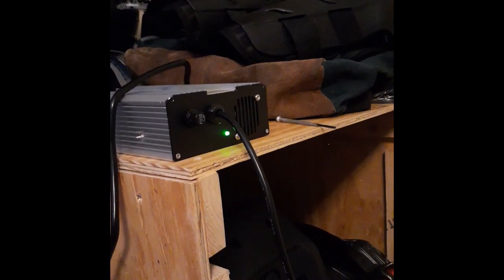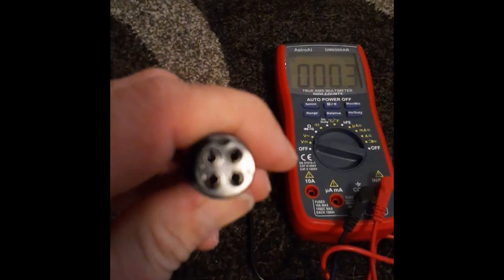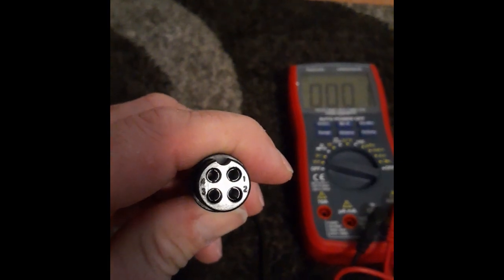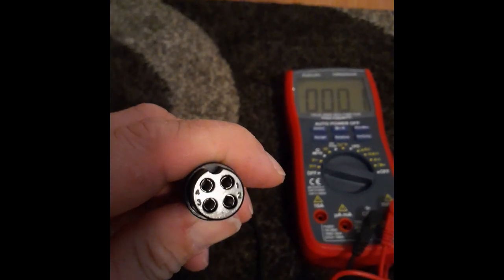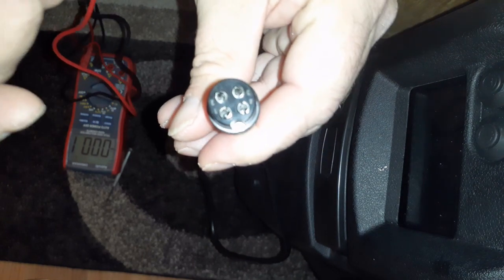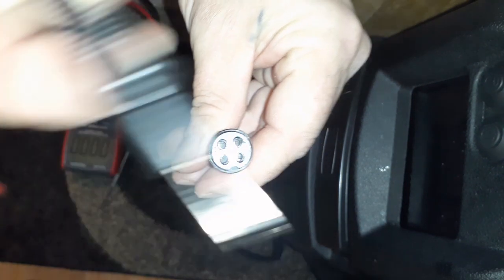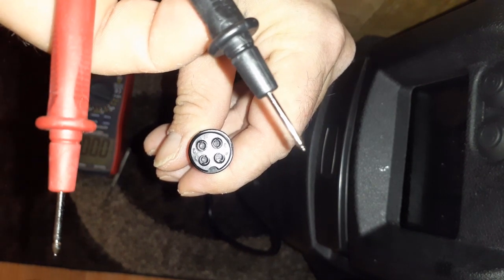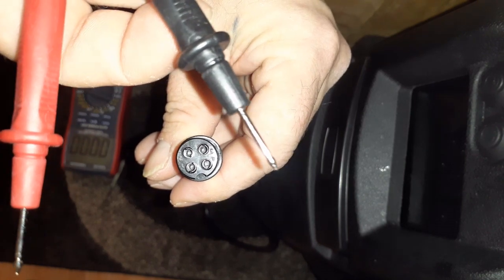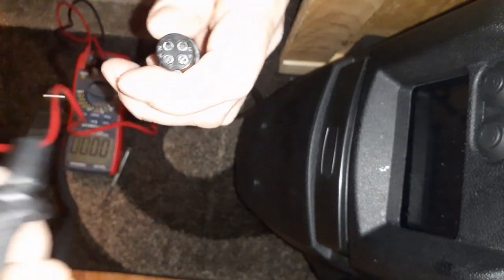Let's get this thing apart and get into it. The power is on for the charger. We're going to stick these two pins inside the holes labeled number one and number four — it's the two holes just behind that little cutout. Those two holes, right behind that cutout — it doesn't matter which pin goes in which hole, positive or negative either one.